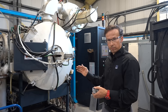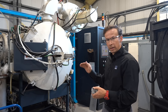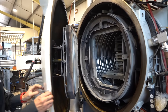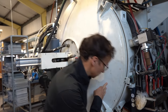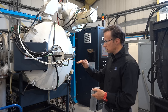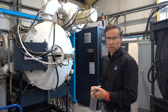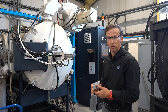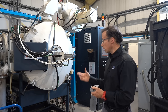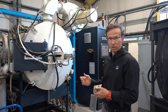The sintering furnace will go into vacuum to pump all the air out. Once that's been completed, it will slowly warm up and then add hydrogen along the way, going into a very low — just above atmospheric pressure — hydrogen blanket. It will take steps, going up to 600 degrees and then continuing up to about 1360 degrees for this 316L component to be fully densified. Then it will slowly cool down over a few hours, finishing with a quench procedure so the doors can be opened and parts taken out safely.